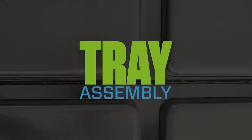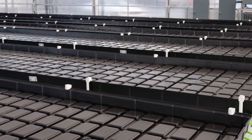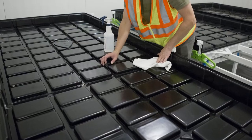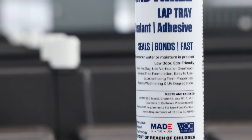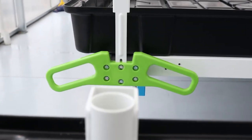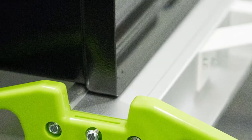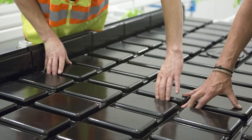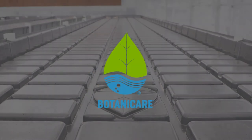Step 11: Tray assembly. Dry fit all trays on the table and make sure all seams fall into the recess in the table extrusions. Clean all surfaces that will be bonded with isopropyl alcohol and clean cloths. Before using Bond 3 lap tray sealant adhesive, carefully read and follow all warnings and directions for use. Beginning with arch 1, install trellis brackets by inserting them into the cavity and tightening via center screws on the handle. Slide the drain tray against one side of the extrusion. Apply tray sealant to the seam and install trellis brackets to help keep trays tight and aligned while drying. Wait for the adhesive to cure. Your Botanicare slide bench is now set up and ready.